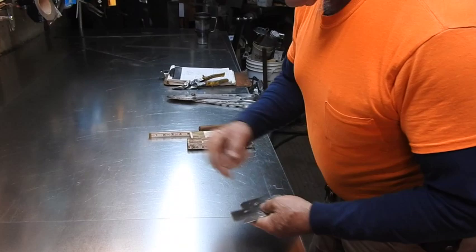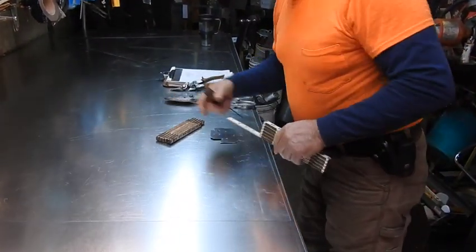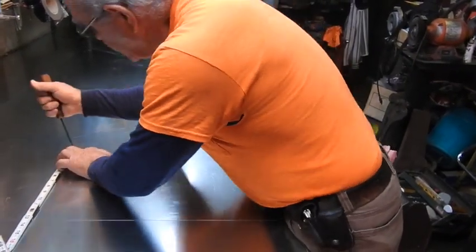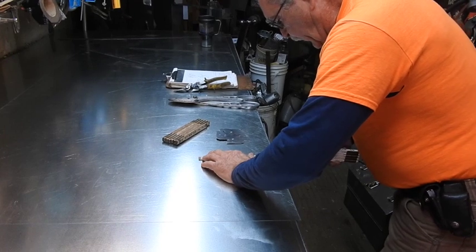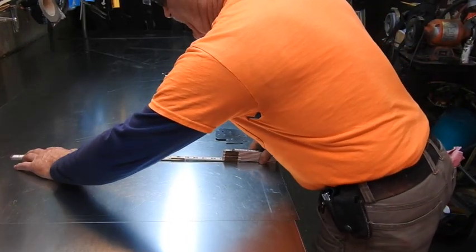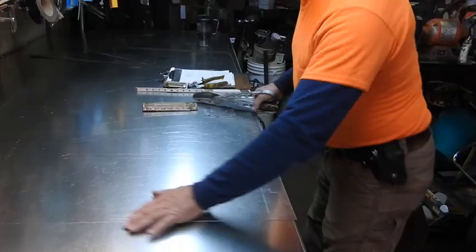It's going to be a two-piece fitting with a flange that needs a half-inch double hem — we can mark that. The fitting is 12 inches long so that'll be 13 inches from the edge and then one inch back for the S&D. It's 8 by 20, so 8 plus 1 for the Pittsburgh is 9 — mark that 9-inch on the 1-inch mark. The width is 20 inches so we add 20 and a quarter, and again 20 and a quarter on the 1-inch line.